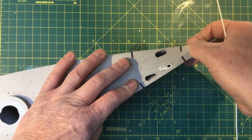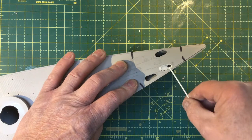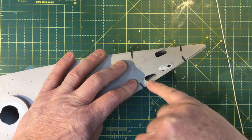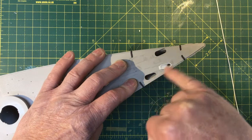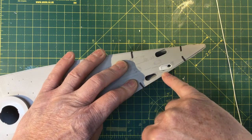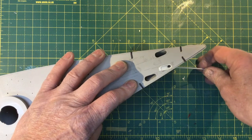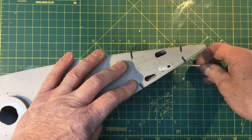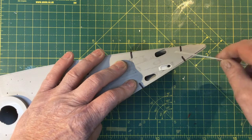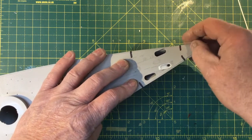Okay, so we've got the deck in the correct position at this point, and the resin hawse pipe opening in place. What I'm going to be doing is packing out the area underneath here and up to the deck level with some two-part epoxy putty. And what that'll enable me to do is to drill through the putty from outside and up towards the hawse pipe opening here and connect the hawse pipe from the deck to the outside of the hull. That's the theory, so let's give that a go, see how we get on with that.